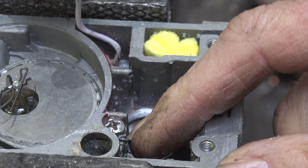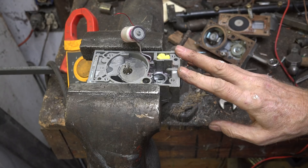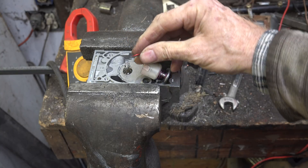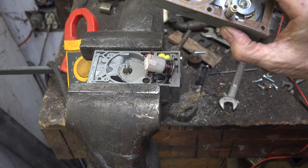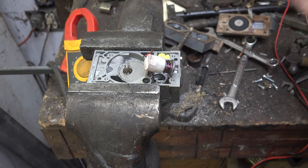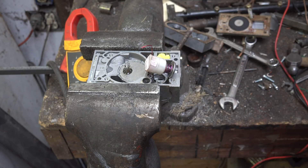You can see that wire has actually corroded through. When I pulled this off, the wire was going right in there and it was corroded in two. Obviously because we had water in this valve, there was a good chance it was not going to run anyway — but that was the problem. A simple failure originally caused by water in the valve. How it got there beats me; it could have got through the screw holes with a roof leak, or the thing was left outside — who knows. That's why the valve failed. None of these parts are replaceable; I just did this to see if I could figure out what happened.